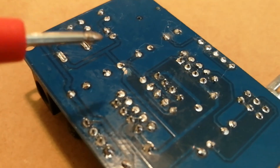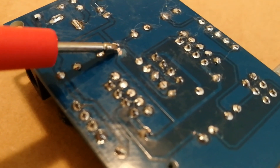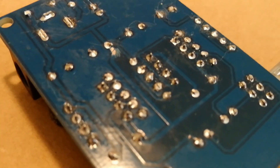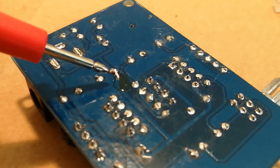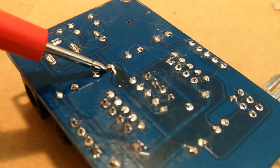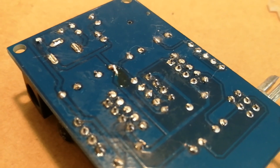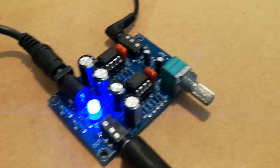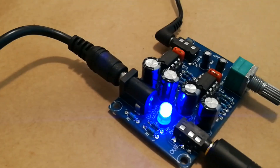I've scraped back some of the circuit board trace and I'm going to glob a little bit of solder over it to jump across where I had damaged it, and we'll see if that fixes things. I tested with my meter and that seems to have done the trick. It's fixed — as you can hear it playing out of the headphones. We'll give you a listen in a minute once it's all put together.